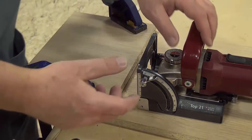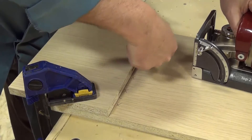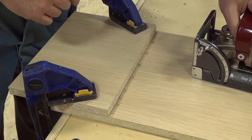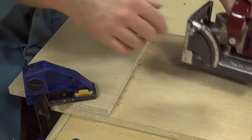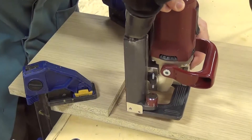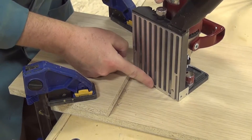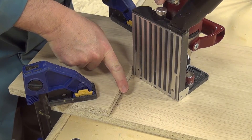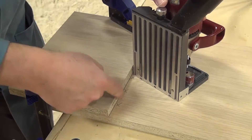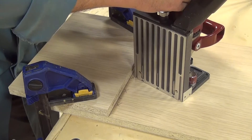The next step is going to be leaving it exactly the way it is. I've cut my three biscuits in like this and I'm going to leave these exactly the way they are. I'm going to take the machine and hold it vertically like this, and I'm also going to use the center mark on the back of the machine and line it up with my layout lines. I'm going to go ahead and do that — you won't be able to hear me talk while this thing is running.